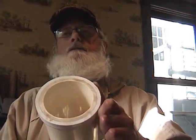I need to make the end plate for the top of the cylinder here. This is the cylinder, so this needs a plate on it. And I'll have a 6-bolt hole pattern in here, some quarter 28 by 3/4 inch socket head cap screws hold this plate on.